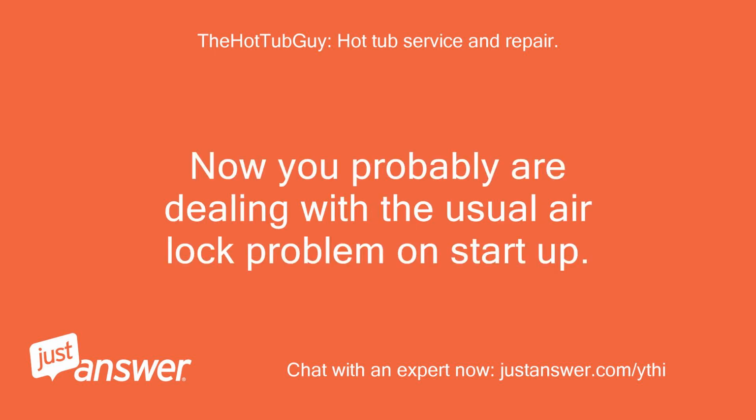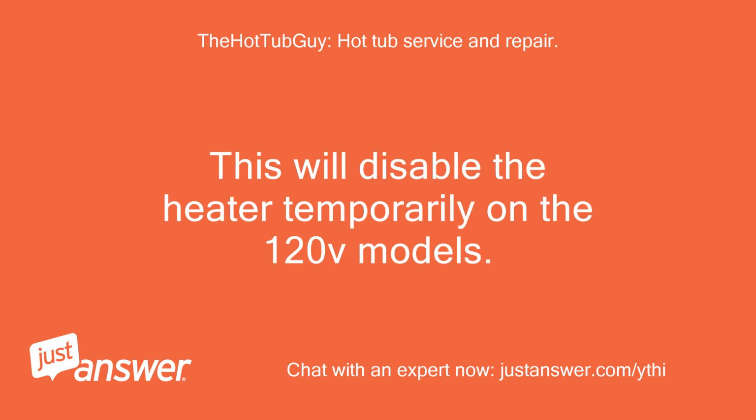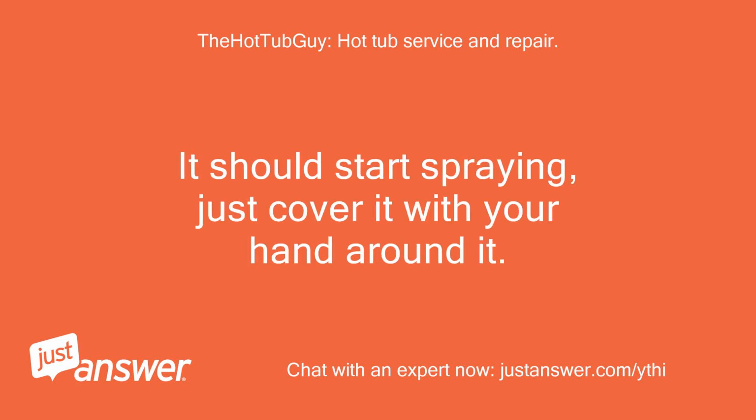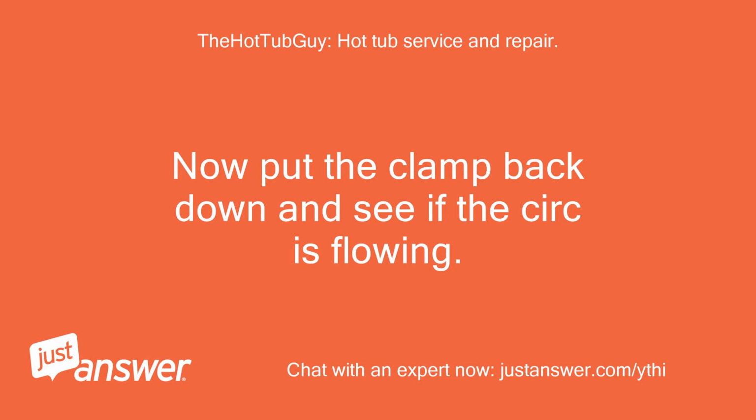Now you probably are dealing with the usual airlock problem on startup. Restart the tub and turn the jets on right away. This will disable the heater temporarily on the 120V models. Now, carefully crack loose the hose coming off the circ to the heater and let any air out. It should start spraying, just cover it with your hand around it. Don't remove the hose, just break it loose enough to burp the pump. Now put the clamp back down and see if the circ is flowing.